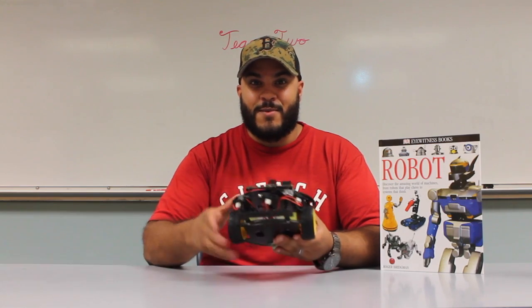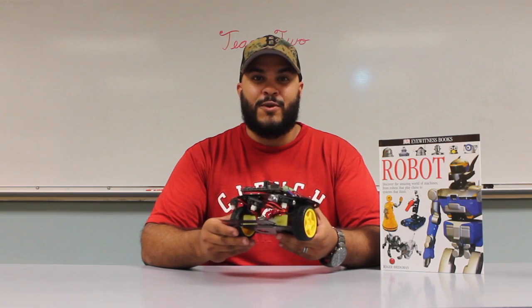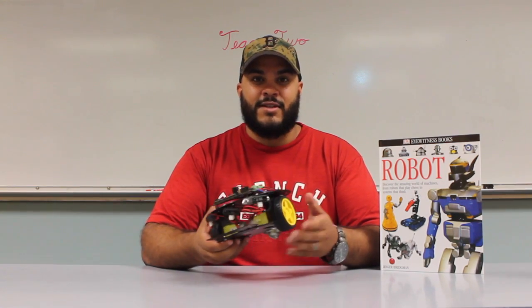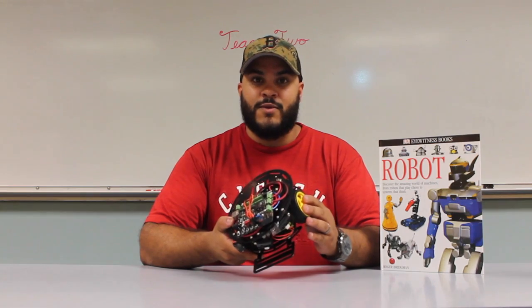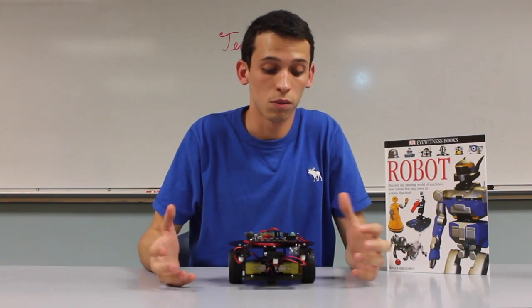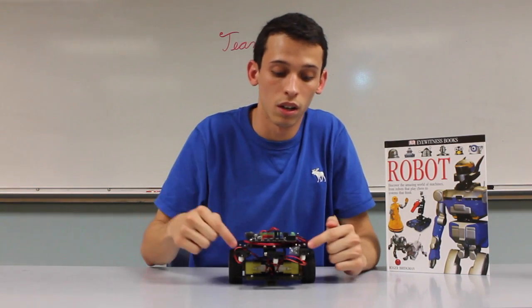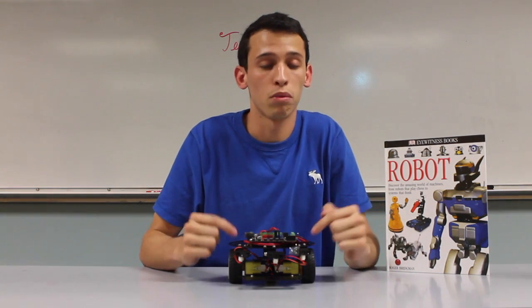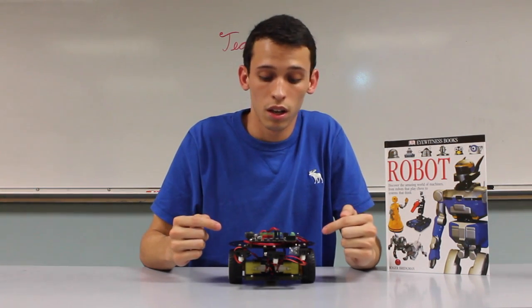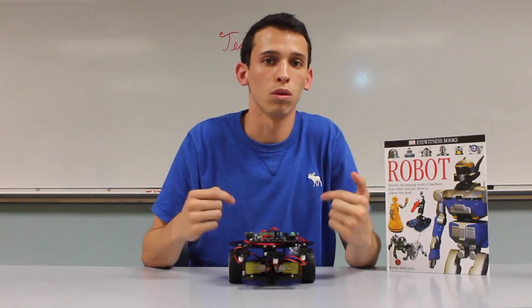This is Thomas, our Arduino robot. It has 2 servo motors in it that control the wheels and the direction in which they go. It's controlled by a digital signal that converts it to an analog control that moves the wheels from the PWM controllers. This is an Arduino Romeo card that is pretty much the brain of the robot. All of it is plugged into it. It receives a signal from the 3 sensors, and based on the program that we put into it, it gives the motors an output that makes the robot work.